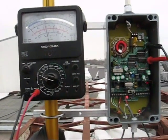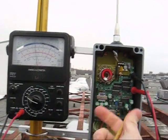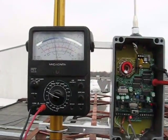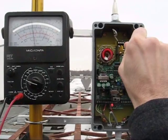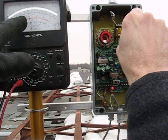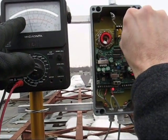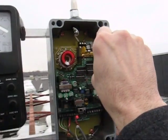When you do this — it's about 20 degrees out here with the wind blowing — you always want to take your hand away. When you put your hand close and make an adjustment, you can affect the reading. At 4 volts, we're going to tune the unit now that we've got a solid ground connected. We're going to turn the pot until we get the maximum. That's why I like to use the analog meter — you can see the swing. I'm trying to get the maximum voltage out. We found a peak there.